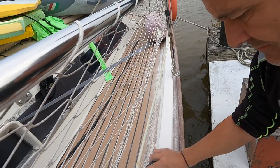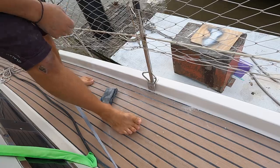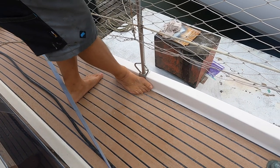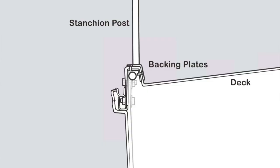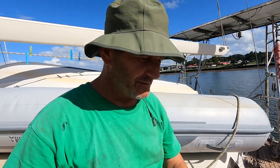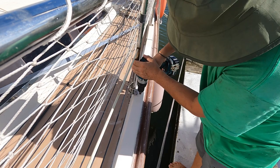The other thing I've got to contend with is these little black insects that are all over the place — as soon as you start painting they land on it and you can't get them off, so the only way is to sand them off later. Now I've got to tap the bolt holes — I'm going to drill an M7 and then tap it with an M8. G10 doesn't need aggressive treatment, just a gentle screw in there. I also have to be really careful because there's a gas pipe that runs under the toe rail covered in PVC pipe — I can feel it, but I've just got to be extra careful not to push too hard when drilling through. For any gel coat job I always finish with a little countersink — it stops creeping cracks from the sharp edge, gently rounds it off, and lets the Sikaflex bed in there better for a nice watertight seal.